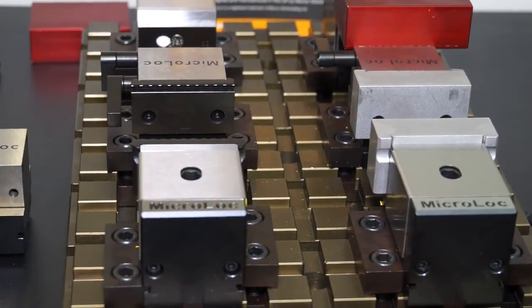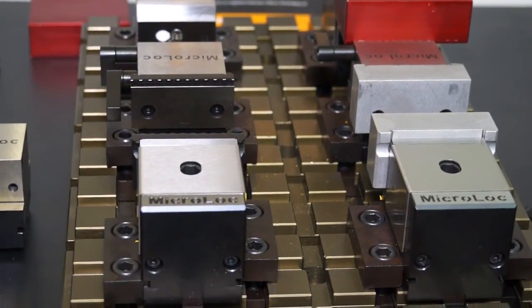So I'm an engineer, I've got a machining centre that's got 750 millimetres in the X axis — can I come to you and say I need a base plate that's 750mm in length? Exactly, yeah. Generally speaking, most of ours are made to order anyway, so whatever the size — we can do up to about 1500 by 750 in one piece, but we've done three or four metre long tables before, just by using several base plates.